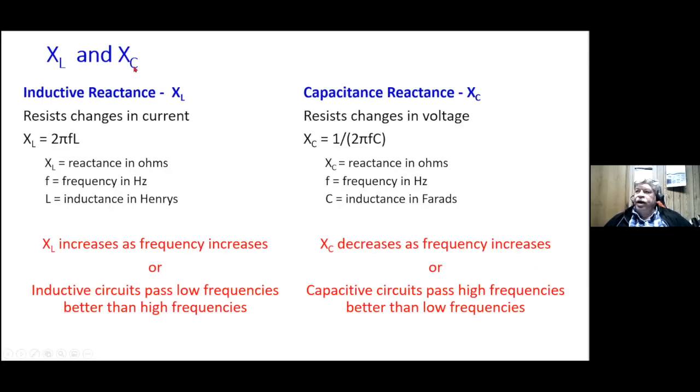Now, we use the symbol X to describe reactance. We have X sub L for inductive and X sub C for capacitive. Inductive reactance just resists changes in current. It tries to avoid quick changes in current and builds up the magnetic field. And the formula for calculating it is X sub L equals 2 pi times the frequency times the inductance. X sub L is in ohms. We call it ohms, just like resistors, but they're really not the same. Of course, the frequency is in hertz,